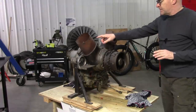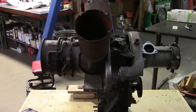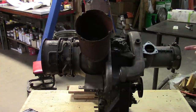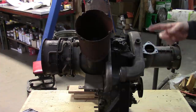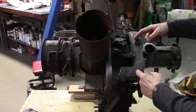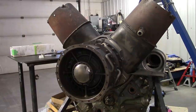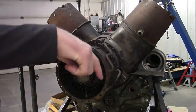So these are the exhaust pipes — they come out the middle. The air inlet's over there. What he's taking off is the compressor delivery tubes; they come out here to a cap right there. The compressor inlet is here, there's a bleed valve there for stall control. It's a large scroll compressor after an axial compressor. The compressed air goes from the front of the engine around the outside to the nominal rear of the engine. Then, unusual for what people would call a straight-through turbojet, the air makes a 180-degree turn.